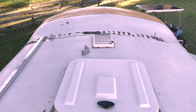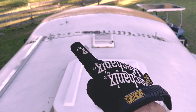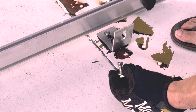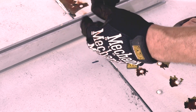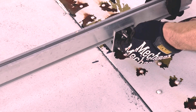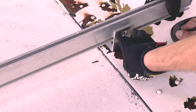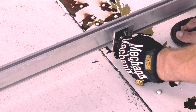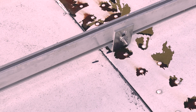Our objective here is to use these large panels — just like the one on the golf cart — and because of the dimensions, we want about 52 to 56 inches between the two brackets. These systems are designed for solar, so rather than reinventing the wheel with unistrut and creating barriers that trap water, we use something already designed for solar. It's all stainless, all aluminum, and comes with serrated flange bolts — in my experience you don't need any Loctite or anything. I've had zero issues. Tighten it down with the socket and you're done.